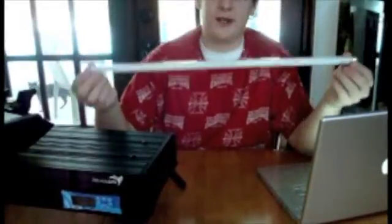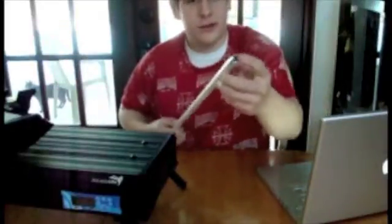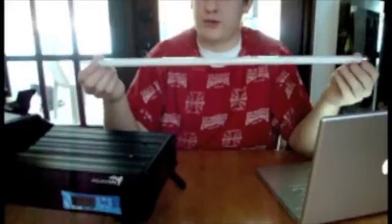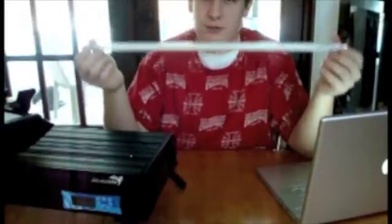As you can see, this is much thinner than a T8 or a T12 bulb. I believe it's 13 millimeters in diameter here. But these will not work in a T8 or a T12 fixture. You know how those are interchangeable — these are not. These need their own fixture. I mean, you can simply tell just by how skinny it is.